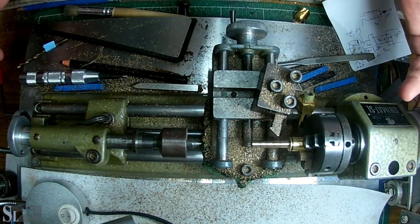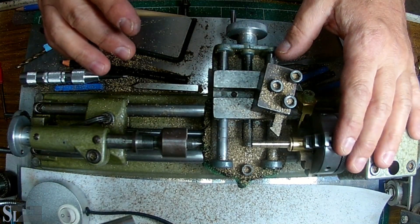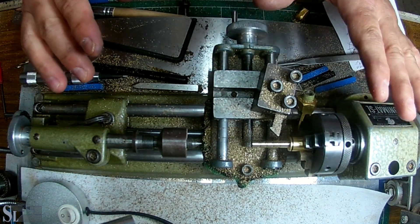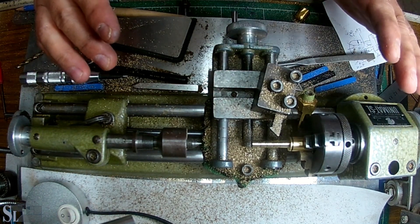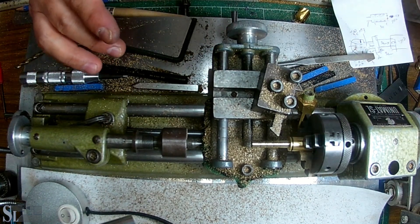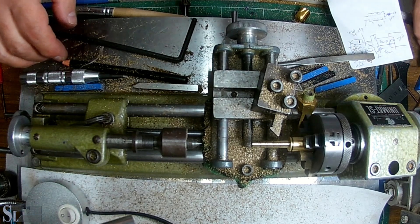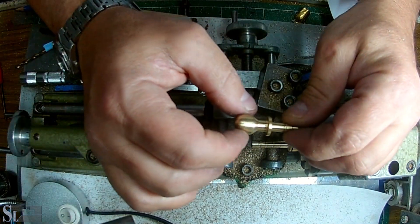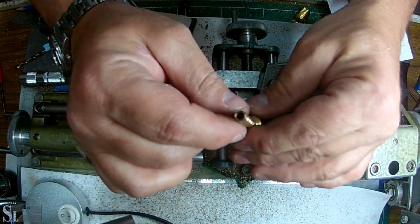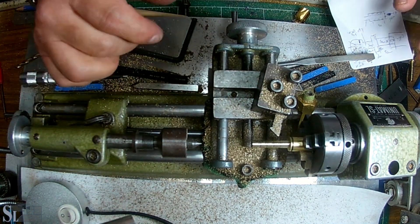This part is virtually done. I could drill it now, but I'd rather finish the head first and then drill it. It's going to be a little more complicated, but I'm going to leave enough flat area on the head, get the finished part here — it's flat enough so the jaws can handle it, and then get it true enough to drill right through.